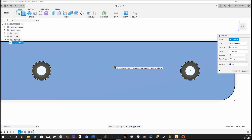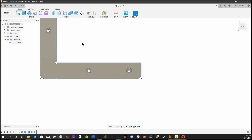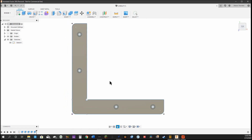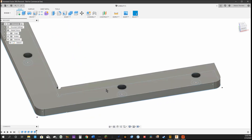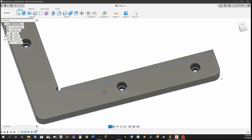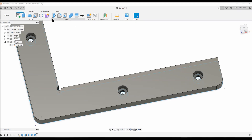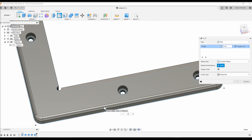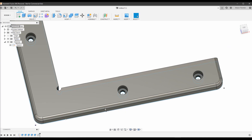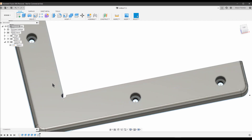Okay so we're going to extrude the whole piece 6 millimeters — that way the corner piece is 6 millimeters thick, which gives you 4 millimeters that your screw head's going to fit into. Now we've got our basic design with our countersunk screw holes but it's really square, so now we're going to do the fillet command on the 3D tools and round that whole edge — we're going to use a 2 millimeter radius on this one.